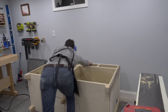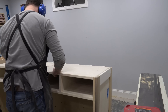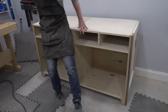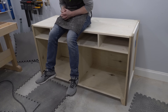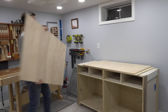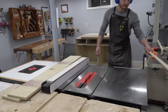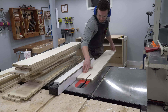The cabinet is now heavy enough to where I can barely tilt it up without any help — moving this thing upstairs into my kitchen is going to be a challenge. Now it's time for the drawers. These are also made out of three-quarter inch plywood and also use rabbet joints to connect the four sides, so I won't go into too much more detail about those, but I will instead focus on the differences between the drawer construction and the carcass construction.